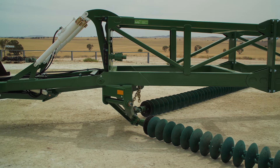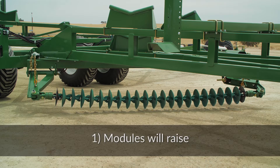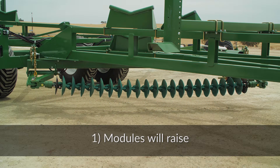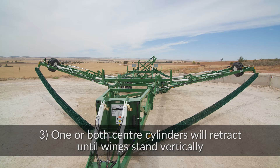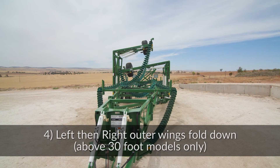When folding the machine, it's important to first lower the front A-frame to working height, as this ensures that all the chains locate correctly on their transport rests. Fold the tail, then the wings, and finally raise the pull.